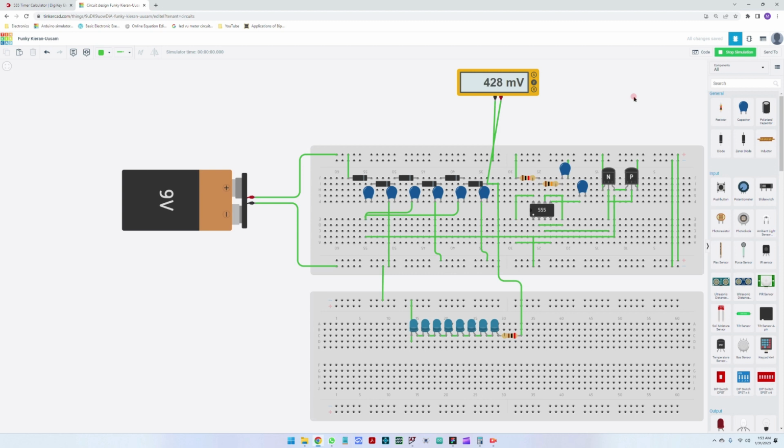But yeah, basically today we have discussed a charge pump, a three-stage charge pump circuit, a 555 astable, and a push-pull driving circuit, and of course a series of LEDs that are supplied at quite high voltage here. And now we can see that the error is no longer in question. All the LEDs are switching at the correct frequency. And I think with this, we conclude the project.